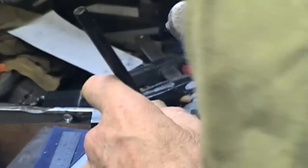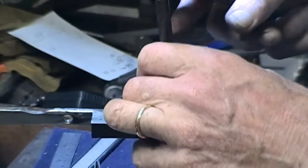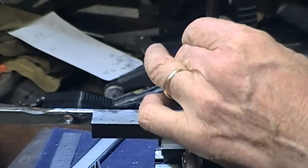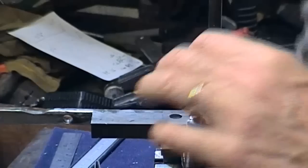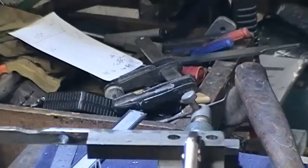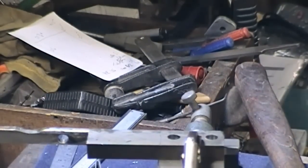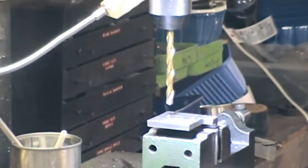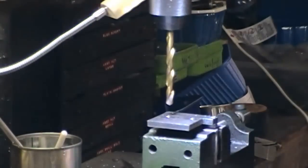That's done and that should take the cap screws nicely with just a little bit of slack so I get a tiny bit of adjustment. I may have to slightly slot one — I'm not sure yet. I'm going to mark up the angle, transferring from the clearance holes. The tapping drill should be 6.8mm but I haven't got decimal metrics, so the closest is a letter I drill — it's only a few thou larger so it should be alright. I think I'm probably going to finish with nylocks underneath when everything's set up.